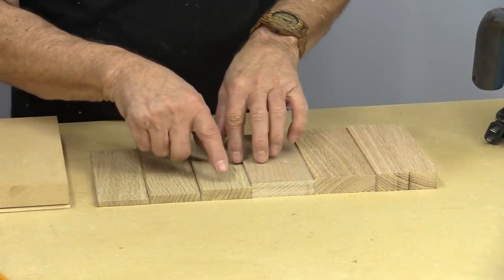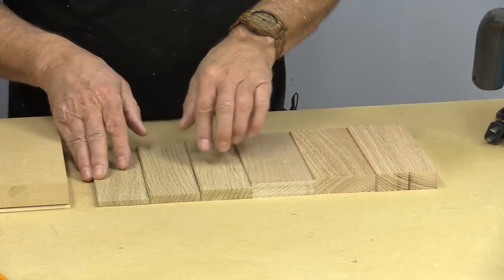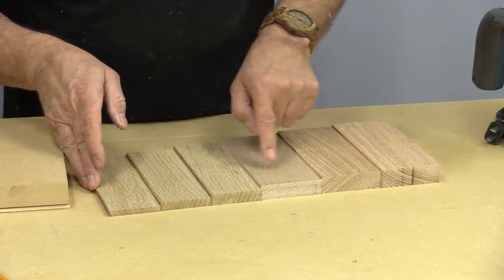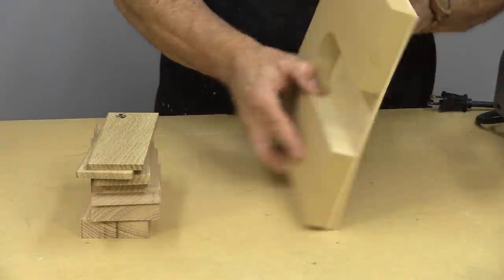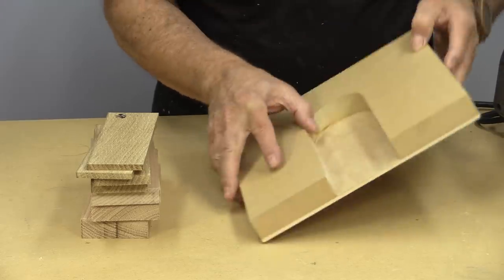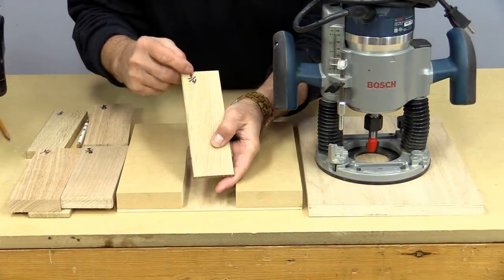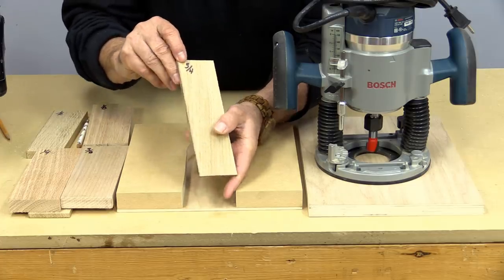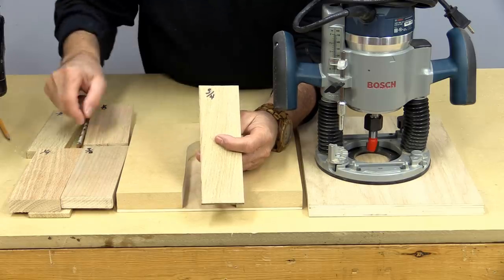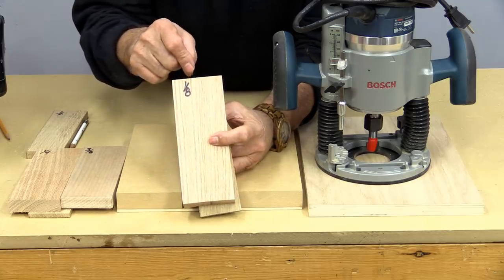I went back into my wood pile and found some other scraps that are even more usable. Some of them I had to trim down on the planer, but you can see how they step down. I've set my light so you can actually see the shadow in there and exactly how they work. I took a moment to screw the back on and countersunk all the holes to make sure it's really tight — these two pieces are very tight to one another. I've marked all of my little depth gauge strips: for example, this one says three-quarters, meaning the depth of cut for my router bit is going to be three-quarters of an inch; this one says one-eighth, meaning the depth of cut is going to be one-eighth of an inch.